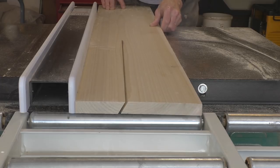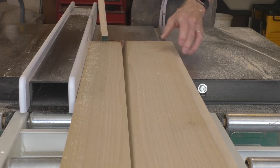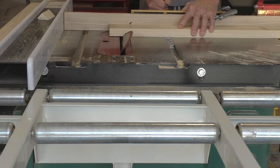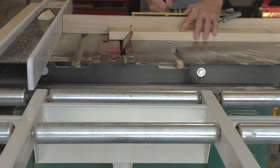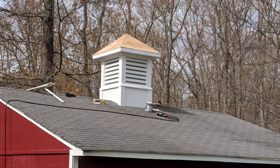The last thing to cut are the fascia boards. I'm cutting a 30 degree bevel along the top edge and a 45 degree miter on each corner. It's probably been a little difficult to envision what this is going to look like, so here's a preview of the assembled product. So I gotta ask — would you make it?